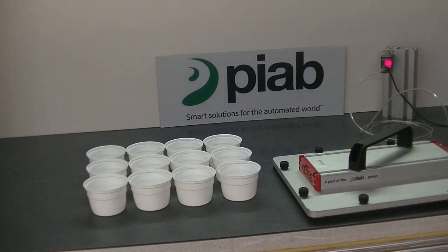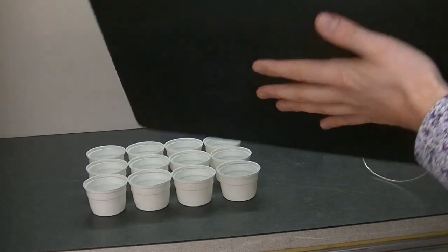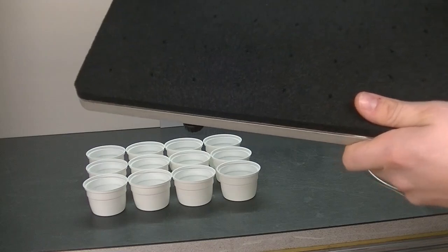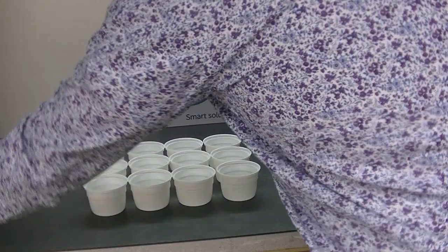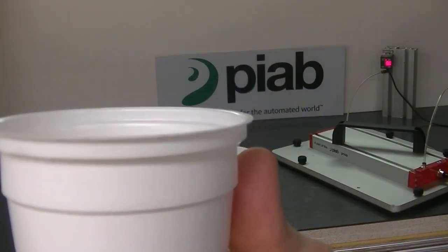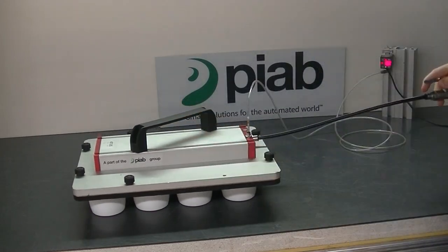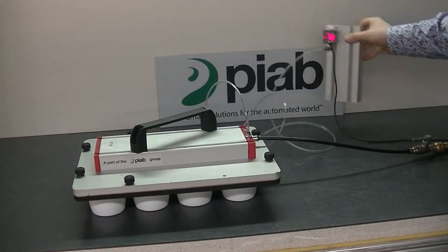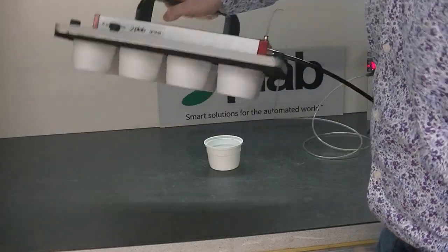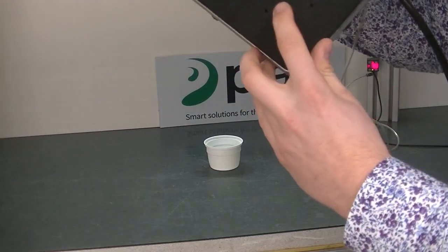The pilot product we're using today is a KVGL with the special cans and jars gripper foam pattern. You can see these really tiny holes here — what that allows us to do is pull vacuum on the inside of the cup, so the entire cup almost acts like a suction cup. Looks like we might have missed one; maybe we had a little bit of leakage.